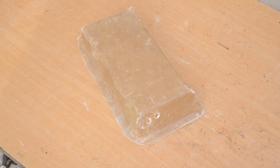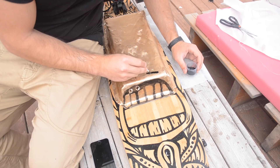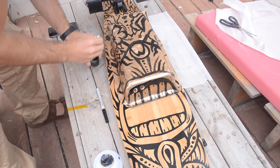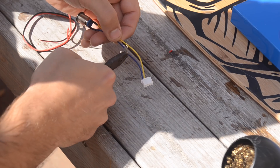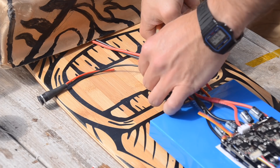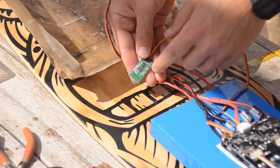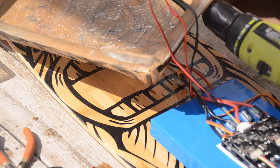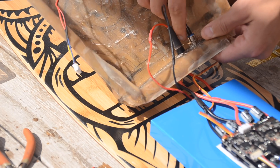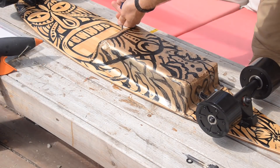I didn't want to ruin the artwork on the bottom of the board with a plain black enclosure, so I first hit it with some tan colored spray paint to sort of match the bamboo wood grain, and then did my best to mimic the original artwork on top of the enclosure. I'm an engineer, not an artist, but I think I did a decent job. I needed to extend my on-off switch wires to reach the front of the enclosure, so I added a length of wire to the existing wires. I also cut the charging port off the battery and passed it through the hole in the enclosure before soldering it back. I also wanted a little window to see the LED on the receiver, so I drilled a small hole and hot glued the receiver with its LED in front of the hole. I put a drop of hot glue on the nuts for the button and the charging port to keep them from vibrating loose. Lastly, I placed the enclosure in its spot and drilled holes through the deck to mount it with wood screws.